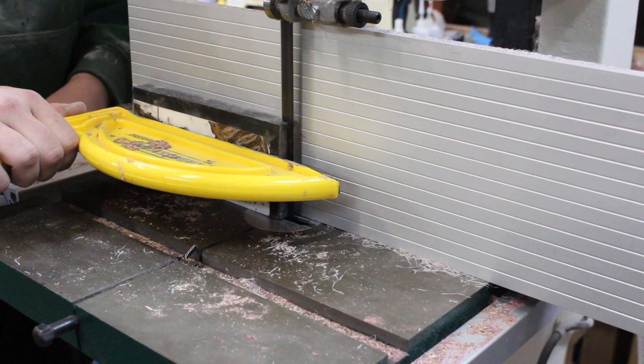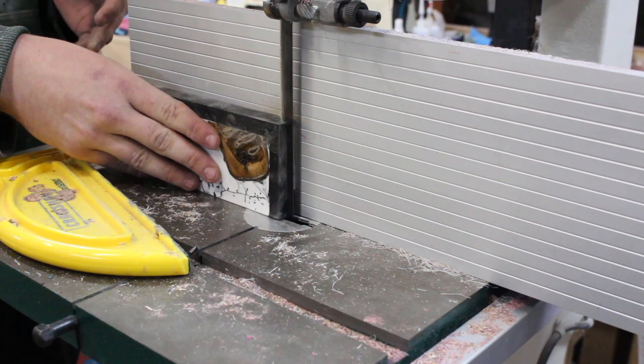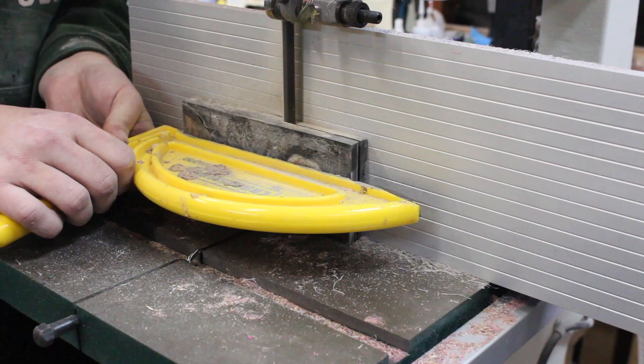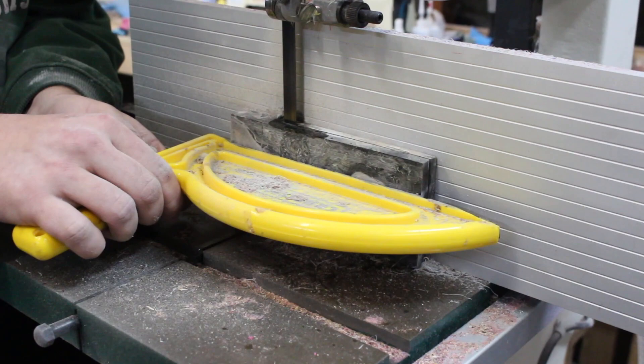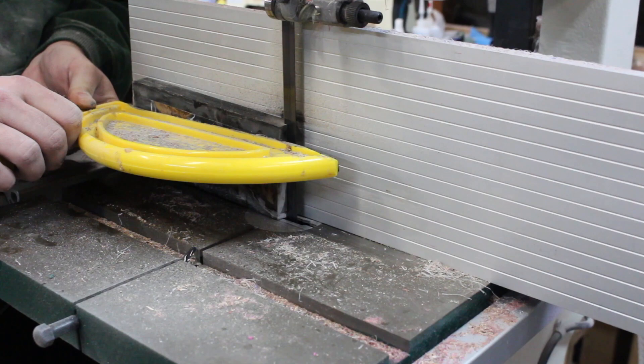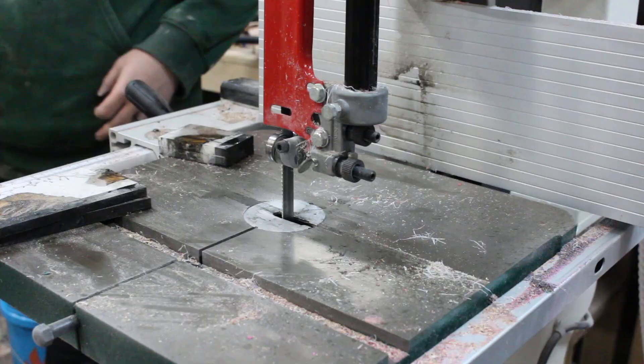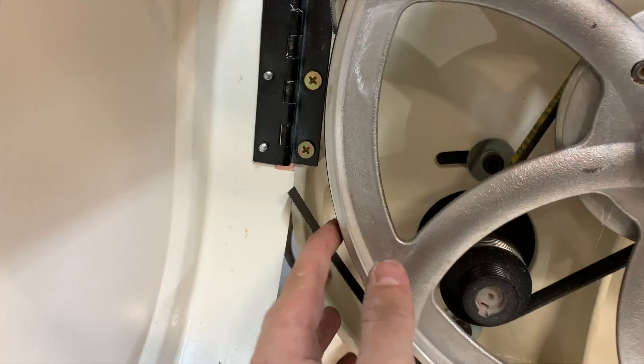That was about 30x speed of me sanding all the pen blanks because it took a long time. Here I'm cutting — or attempting to cut — the block. This is full speed and it's still really slow. It dulled the blade almost instantly. Even applying some WD-40 as a cutting agent, it started throwing sparks, and at that point with a lot of sawdust in the dust collector bin I just cut it where it was — still plenty long enough. The blade got so hot it snapped on me when I was trimming the resin portion, so there goes that blade.